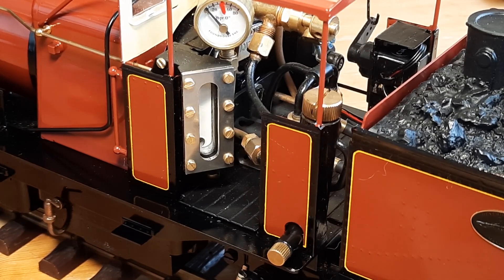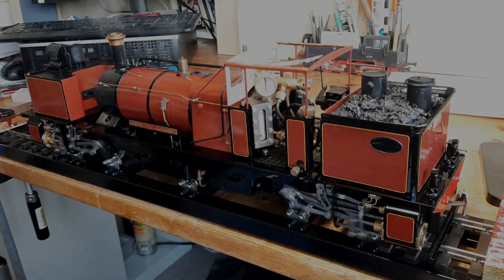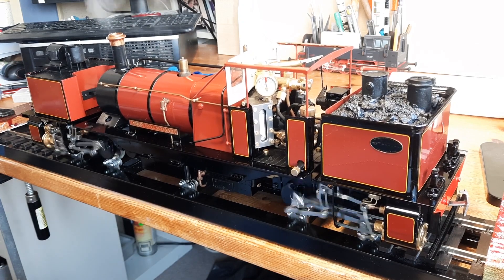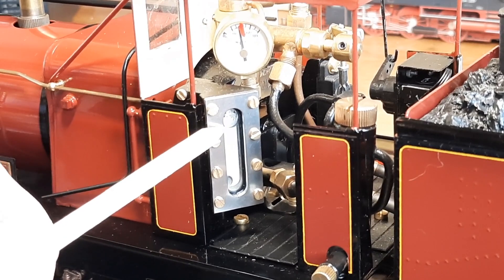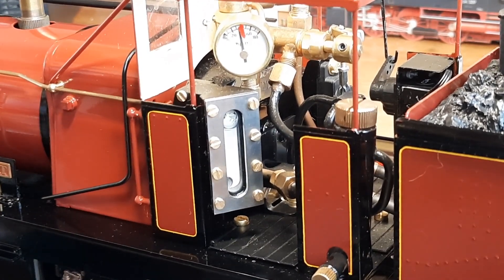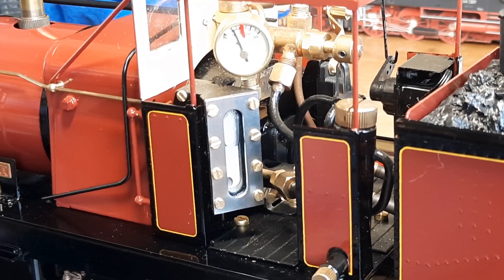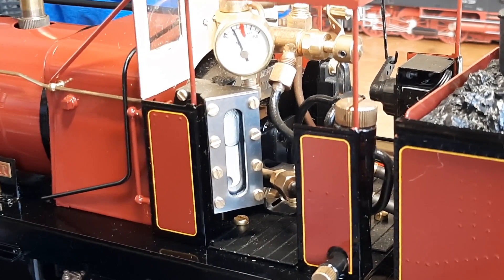The final test is actually to do steam — get it running and make sure there's no leaks. We've just got the locomotive up and running, we'll give it a bit of time to warm up. You can clearly see the water level in the gauge there, and so far it's dry — not leaking — so I'm quite happy. Indeed, for the rest of the running session the gauge remained perfectly dry, so I'm well happy with the result. I hope you enjoyed this video, and thanks for watching — till next time, bye-bye.